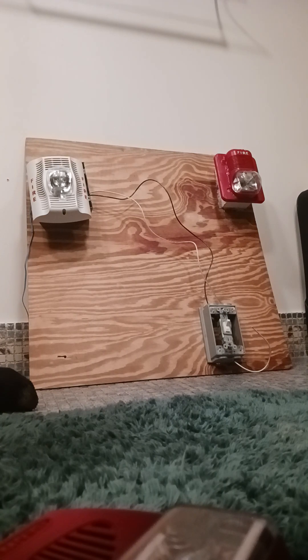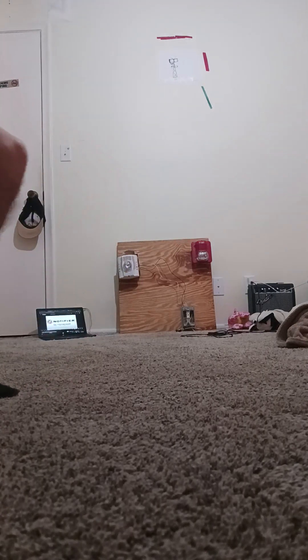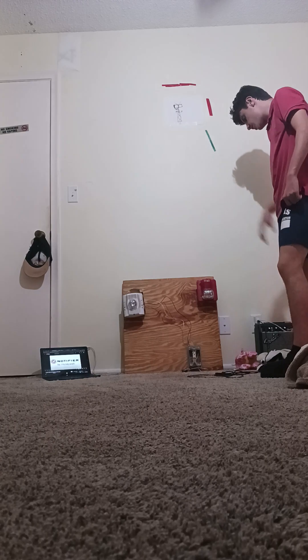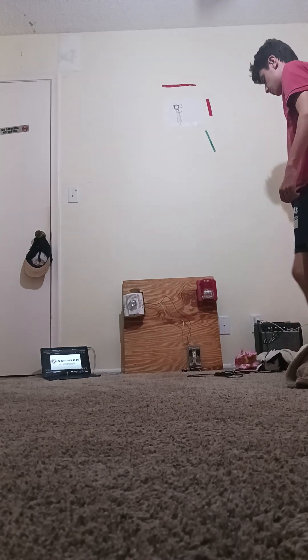Now let's go ahead and see how it works. I'll bring it to the room and then we're done. I'll be setting off the speaker and the strobe together. Now I have this alarm set up. I have a fire alarm board. The camera's on right here. I have the voice notification message set, and the strobe will be on and the speaker will be on. Let's go ahead and pull it and see what happens. I'll reach down to the switch and activate the strobe and speaker together. Here we go.